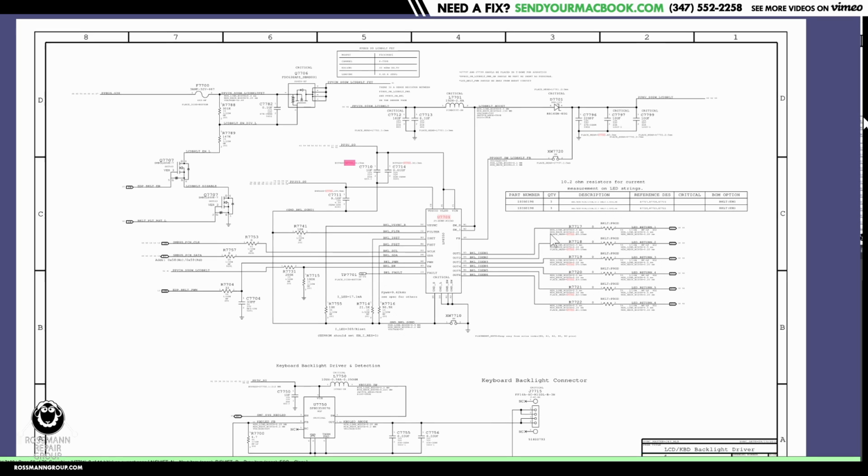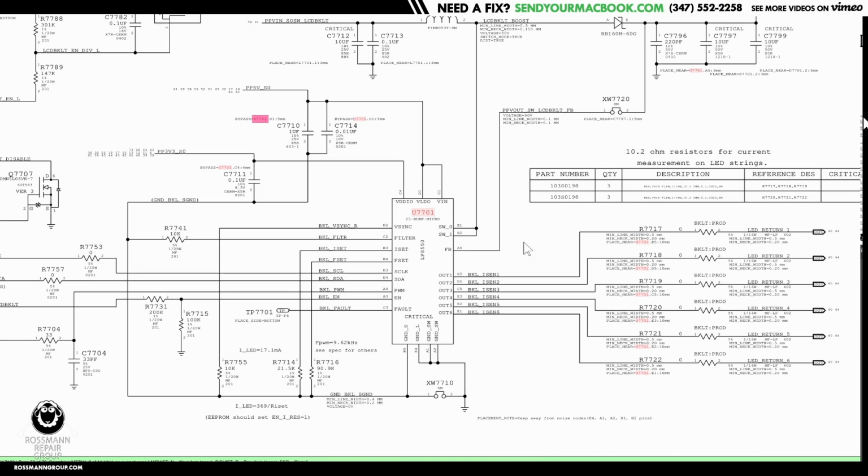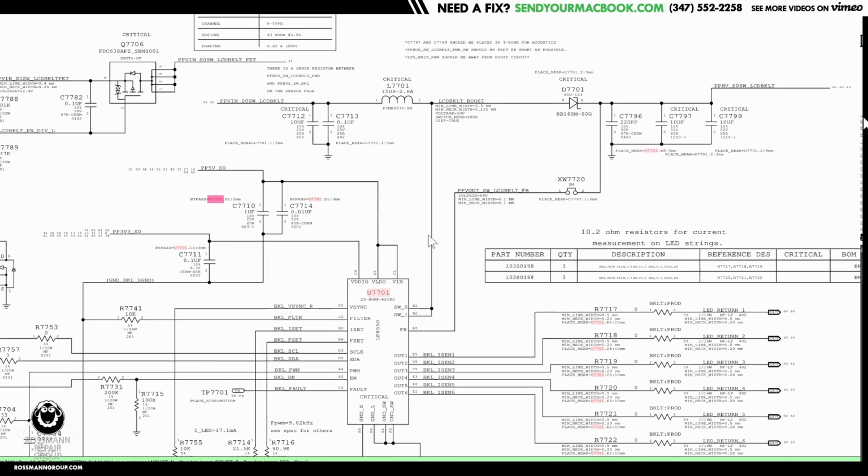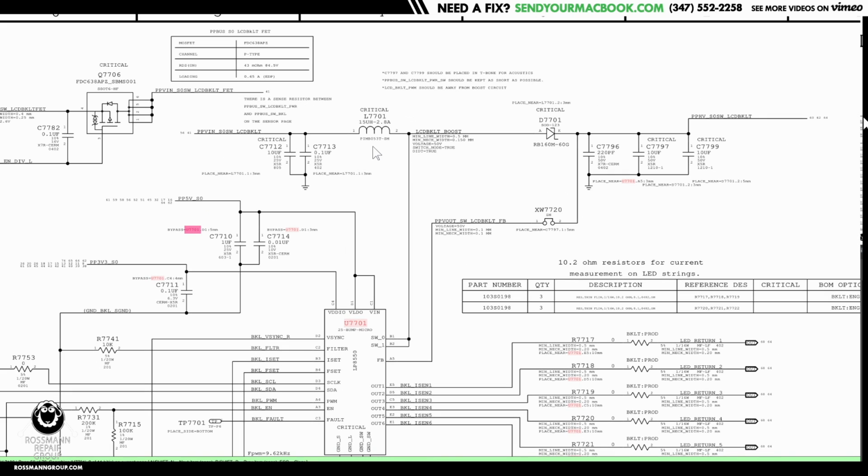So over here, you see it says SW. That stands for switch. The LED driver that does the work is going to switch that 8 volts coming out of here to ground really, really quickly. And that's going to make the coil mad. And when it does, you're going to have spikes up to 27 volts. But you can't have a spike of 27.0, 27.0, 27.0. That's what the caps are for. The caps are like little batteries. They're going to hold that 27 volts so it's steady.